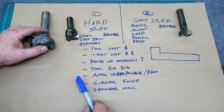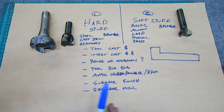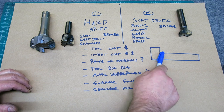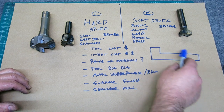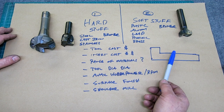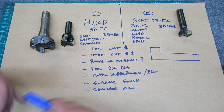And I'll admit that it's not perfect. And there's a million choices out there, right? And that's why videos about carbide inserts are very difficult to do, because there's literally thousands of choices. It's really driven by the job that you're doing, right? That drives the process. So if you have to do that job in Hastelloy, and with a particular surface finish, that's going to zero you in on some choices with the tool manufacturers and the insert manufacturers to optimize that solution, right? So the short answer is there is not a general solution that works for everything.